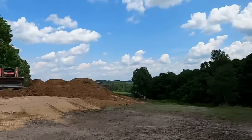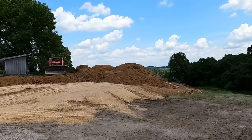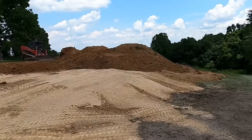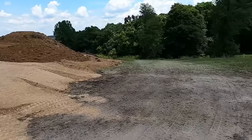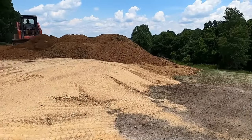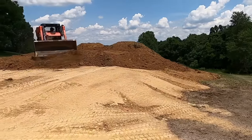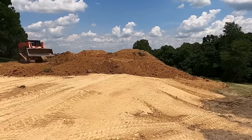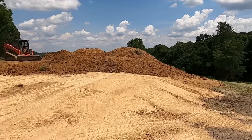All right, I had to go get a drink real quick. But as I was saying, where he's pushing all this dirt, I knew that was low on this end here. I knew that was low because as it comes out, we've got more fill that we've got to do from up where we started. So I knew this side was going to be a little low. But he didn't want me to get no more than 2 foot before he put the roller on it, so that's why I kept this side a little bit lower.